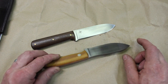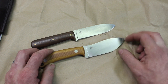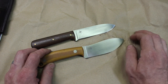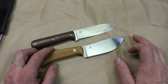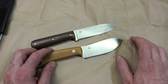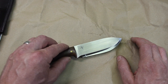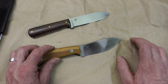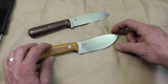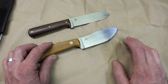Likewise on the Nessmuk. Now, as I pointed out earlier, the original Nessmuk design has a little bit fatter blade here and therefore a little less of a pronounced point, as it were. And so that might be one drawback. On my design here, on my knife, the point is very similar, actually, to the Kephart. And so you really don't lose hardly anything there when it comes to that function, not much anyways. But you gain additional strength because there's more material immediately behind that point. So they're similar in that regard.